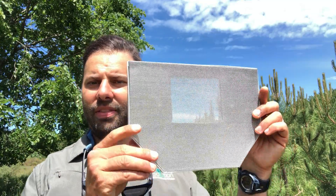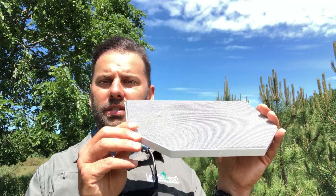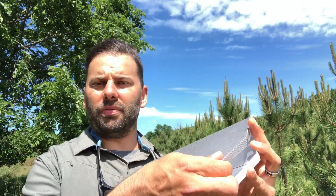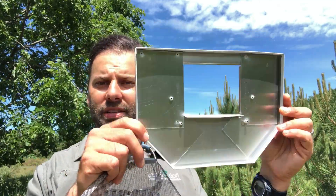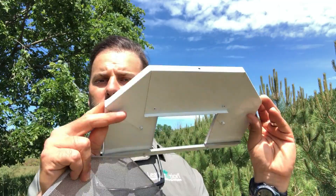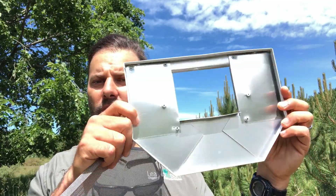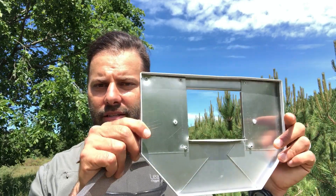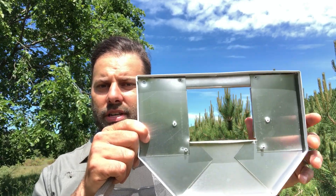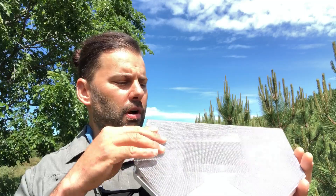This is the straight miter — this is our five-inch size; we have a six-inch size for six-inch gutters. I'll take the top off here — the wind's picking up a little bit. Here's the base; this is a very stable, heavy-duty aluminum base that's fabricated together. There's the opening for all the water to go through. The base is installed on the gutter like this — screwed down and sealed down.